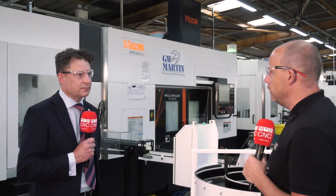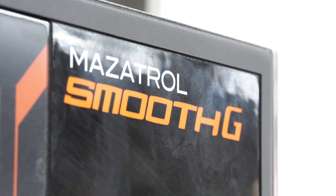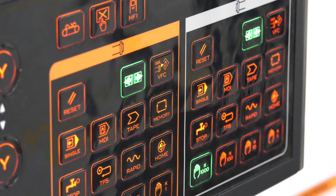The touch time for the operator is a minimum of eight hours. In terms of efficiency — spindle up time on machines like this — we have measurements within the control that look at the activity of the machine tool itself: cycle time, frequency of alarms, set time, and changeover time. On a machine like this we'd normally want it to work at 90 to 95 percent OEE.